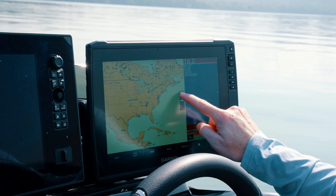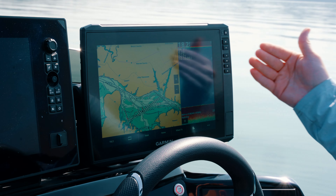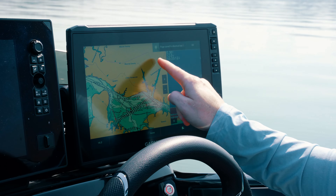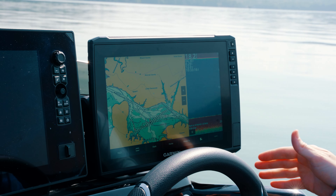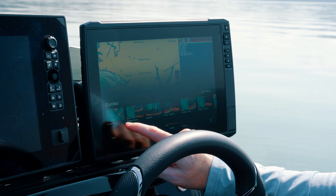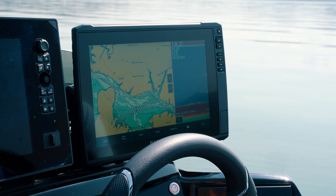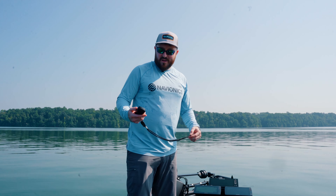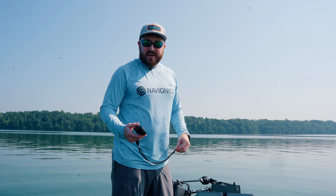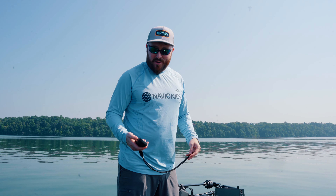Now if you wanted to go all the way down and create your own custom combo — say you want to set something up for your navigation mode, you want to add some mapping — you'll come to charts, we'll do fishing charts since we're in a bass fishing boat. And then we'll also add some traditional 2D sonar for when guys are running on plane. We're going to select the built-in transducers there, and I'm going to slide this over because I want to see a little bit more of the mapping and not so much of the sonar — just a sliver of sonar over to the side. We're going to hit done. You can also rename these — it'll automatically give you a number. There you go, you've got your split screen combo here.